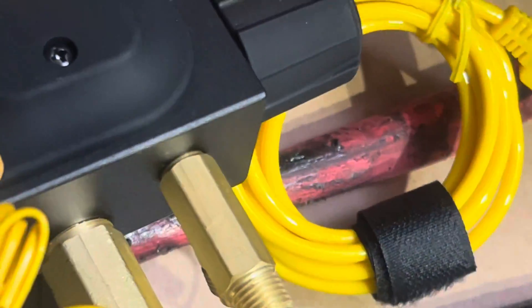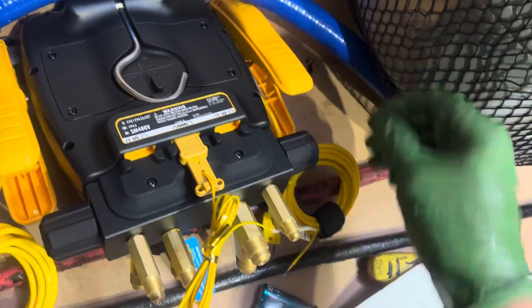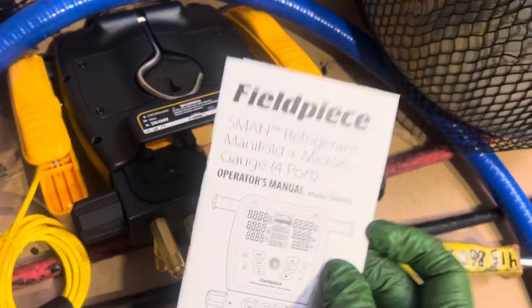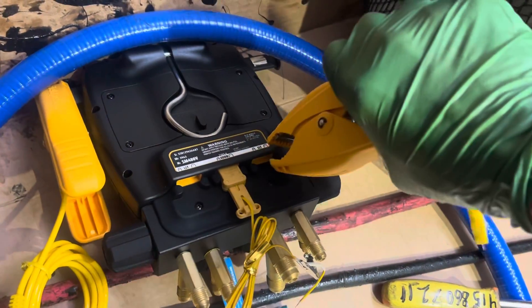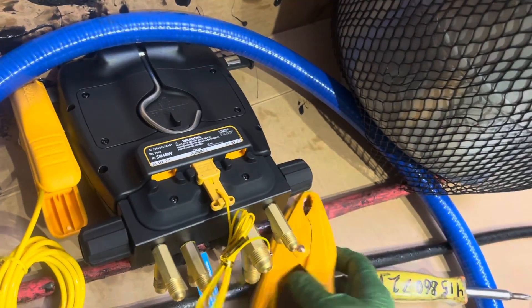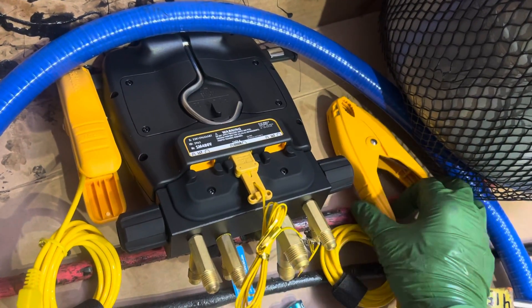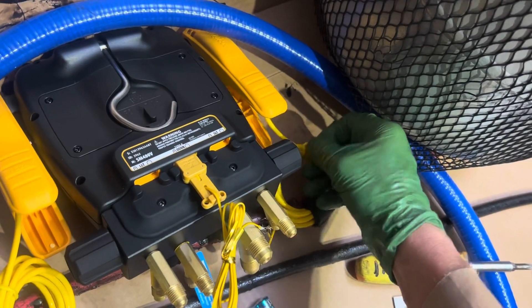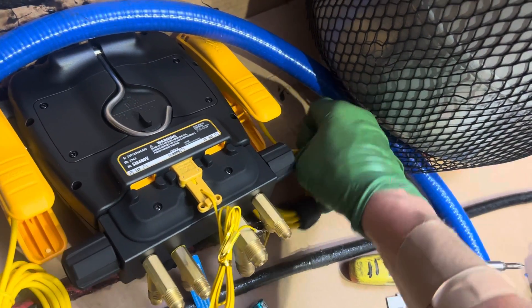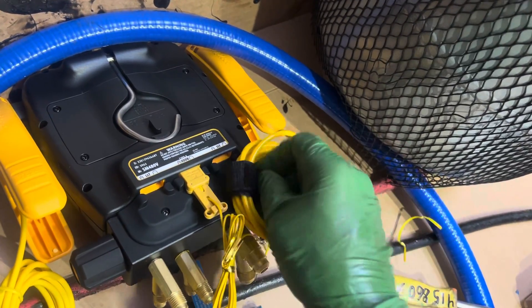The same goes with these ends here. You're going to want to go through the calibration procedures. When you hook up these new gauges, you have to calibrate them if you want it to be perfect. They have good videos online about using ice water — put your sensors in ice water and you can set the calibration on the unit with the pots to get them exactly set at 32 degrees. Fieldpiece has already done that video, so there's no need for me to remake it.